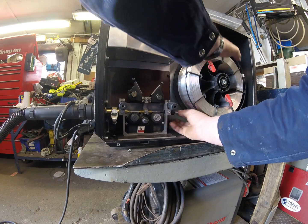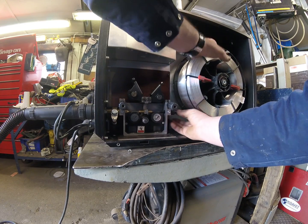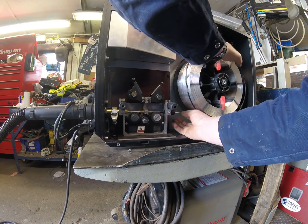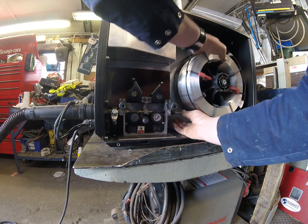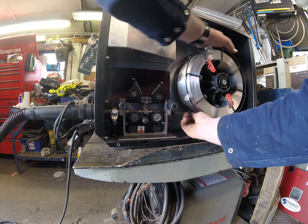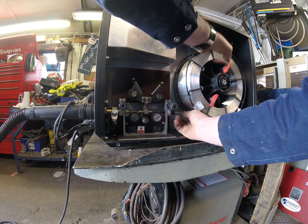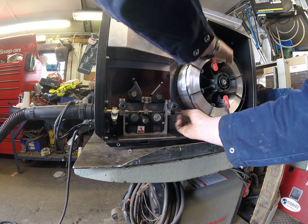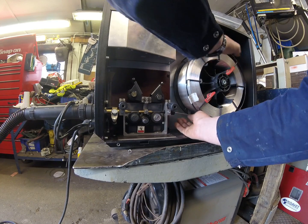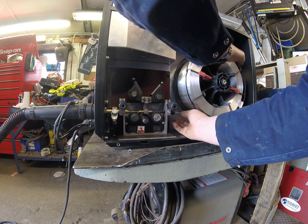The wonders of television — we can probably edit this out. But nine times out of ten you do this and the wire doesn't find its way through to where you want it first time. At the other end I've taken the tip adapter and the tip out of the torch so we've got every possible chance, but it has to get past the drive roll and out the other side through the outfeed guide — it's a bit hit and miss whether it will or won't. But I'll feel it in the wire as soon as I get to that point and can stop without doing any damage.